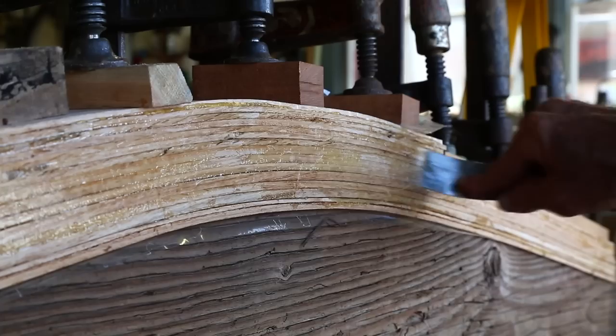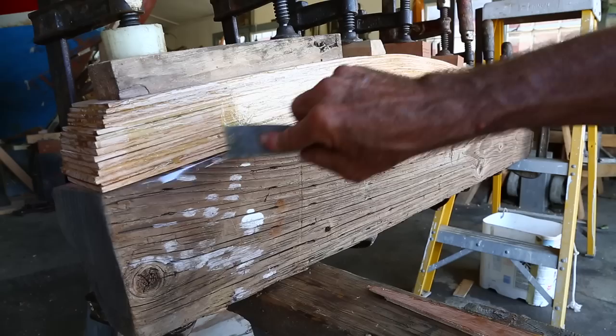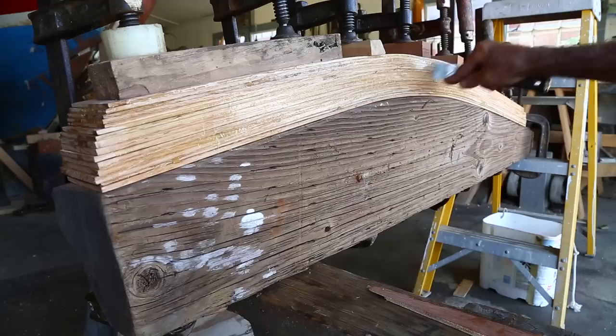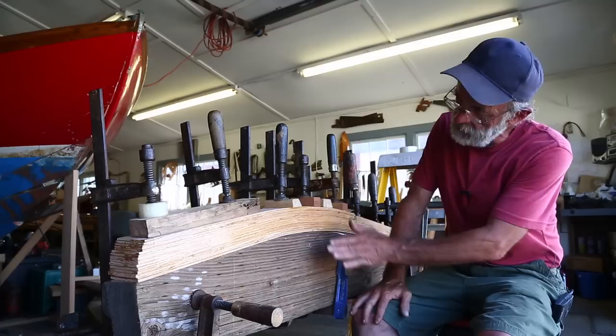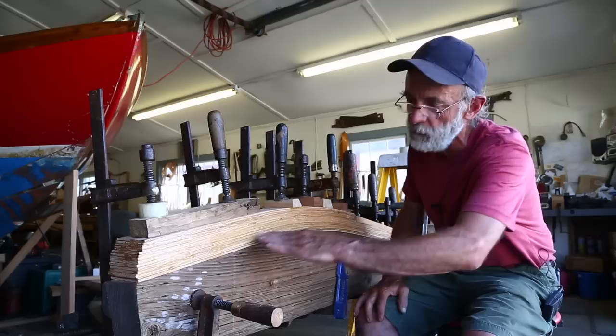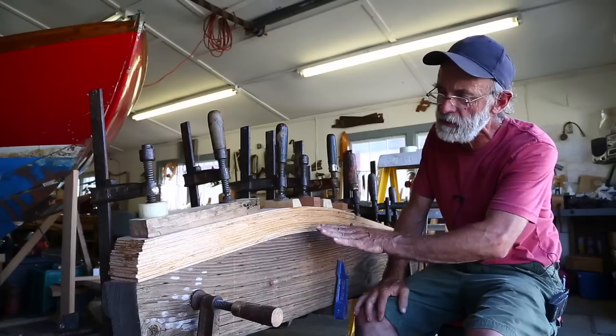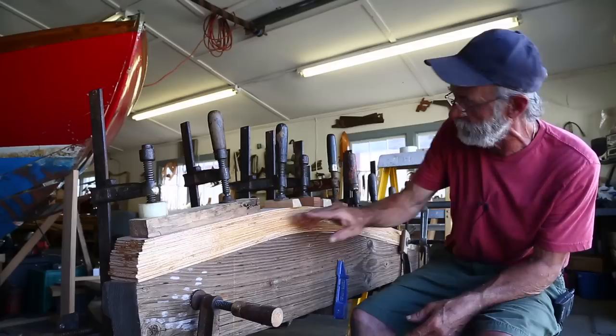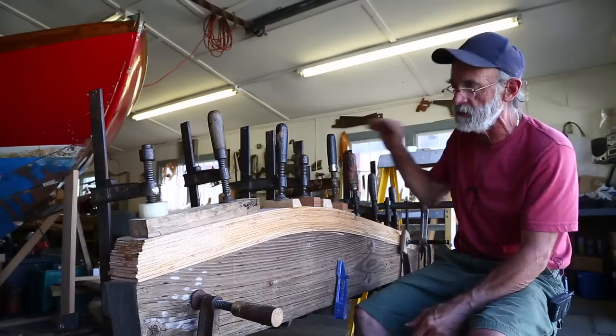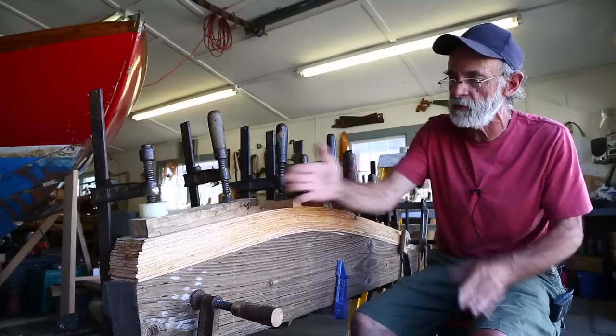The glue is pretty thick and didn't squeeze a huge volume out, but it did squeeze some, and we'll take a putty knife and clean that up. You can notice it looks like the laminates aren't quite touching each other, but those are just imperfections in the edge — the contact is really quite tight and it's very well done. There is our laminated forefoot on the mold, made out of nice thin oak laminates glued up with epoxy. When I unclamp this I don't anticipate any recoil whatsoever — there are so many laminates and so much glue that it will maintain that shape perfectly. We'll take it off, clean it up, taper it in width a little bit at the head, and it's going to go in.